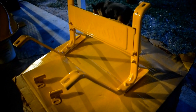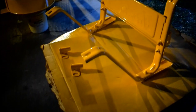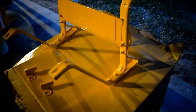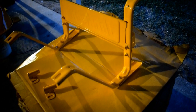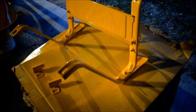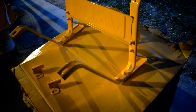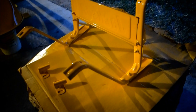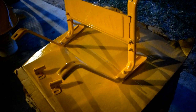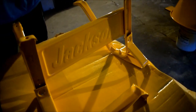and a replacement, I guess handle replacements, instead of carving out our own handles like we were going to do, I think we're just going to buy two handles, even though it's a rip-off price. And what we're going to do to stop them from rotting in the future is take them and paint them with an implement paint. Seal them? After we wipe them down with wash thinner or xylene. Got it. So that we make the top coat tacky, which is probably like a urethane.